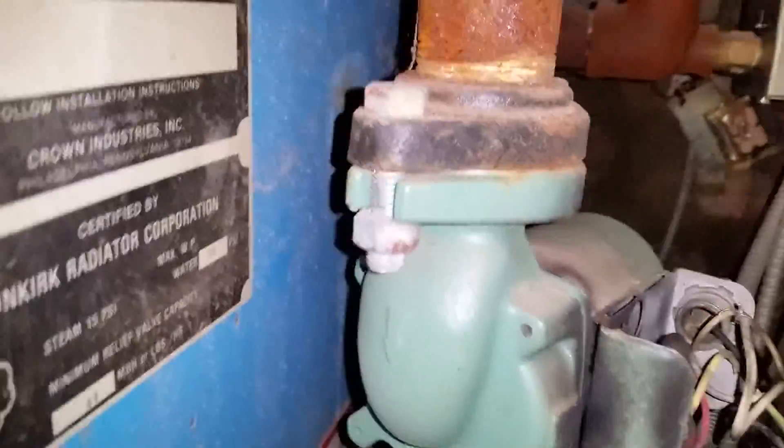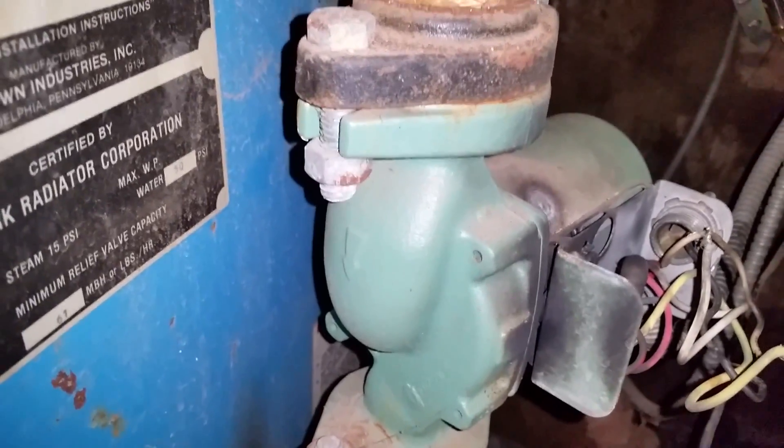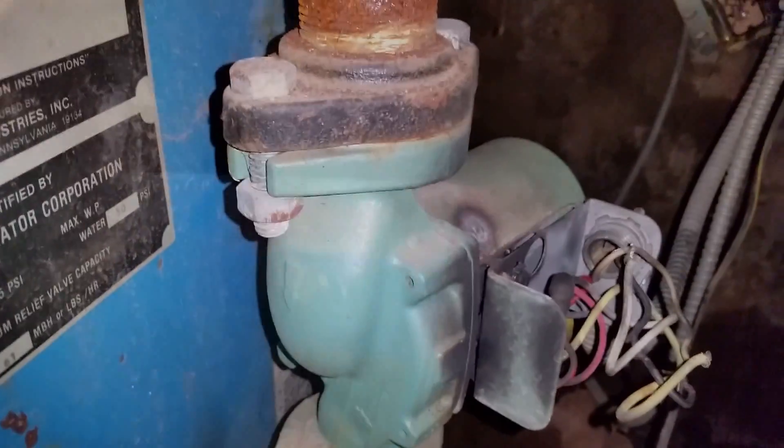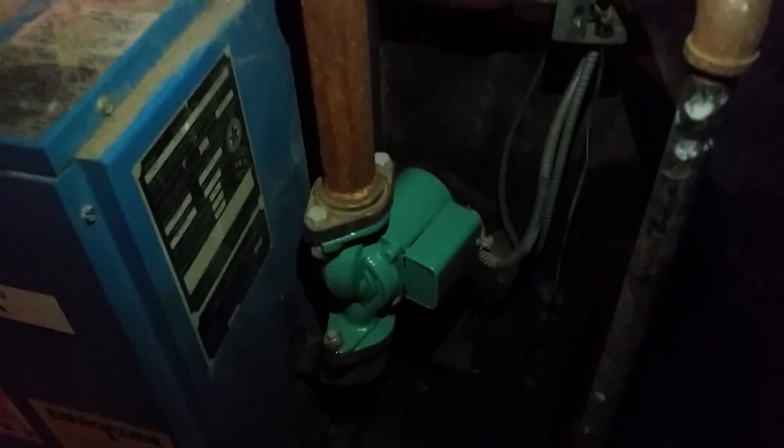Proceed with caution. I've let the system cool down and turned the power off, so I'm going to proceed to taking the circulating hot water pump off. I've turned all the valves back on, and as you can see, this is the new unit. Make sure you open all the valves back up. The old unit was burnt out. Just make sure you tighten up these bolts tightly to get a nice seal, and we're back to having heat upstairs. That's how you put on a circulating pump on a hot water system.